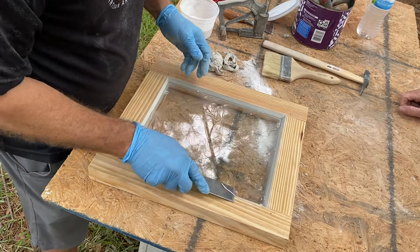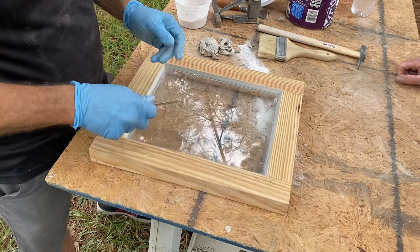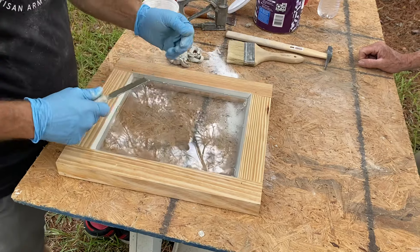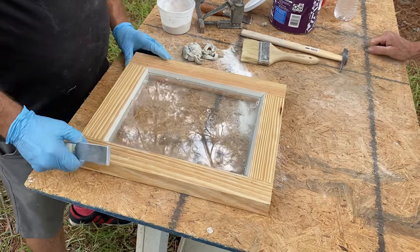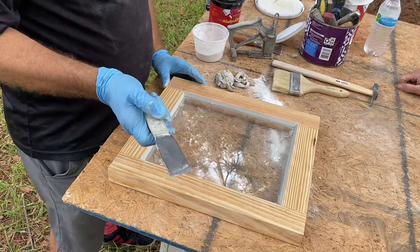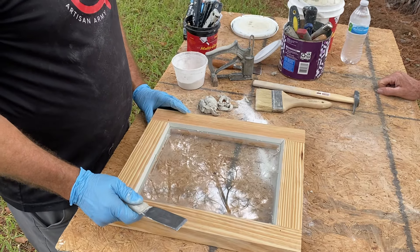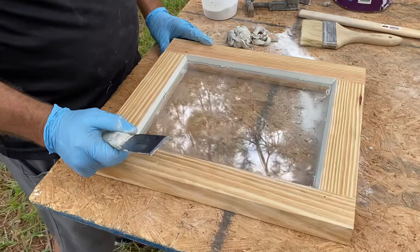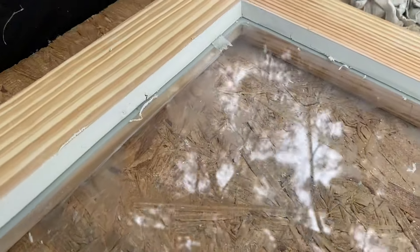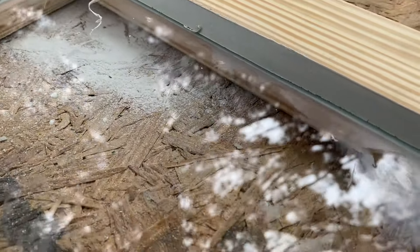This is why we need all the time we have left in this class. You guys have a six-light sash and one light is hard enough. That's why you have to get your sash stripped and primed so you can start your practice. You can be a perfectionist all you want, but at some point you're going to have to get some primer on there and let it be what it's got to be.